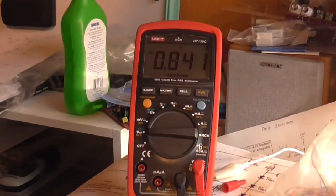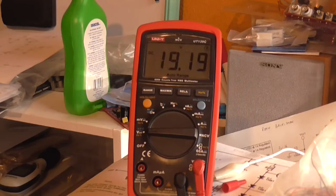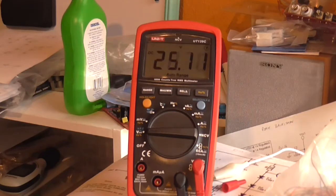So we'll turn this back on. We've got 5.4 volt there. I'll play with the pot. That's a bit better, albeit a little jumpy. 7 volt, 6.5. So the current should now be increasing through the output stage, which is as expected, and I am rotating it clockwise, except it's not remaining stable in any sense of the term. Yeah, that's nowhere near stable.